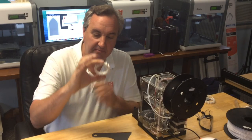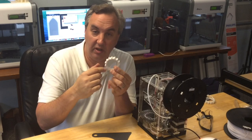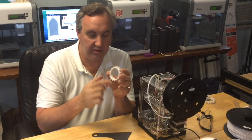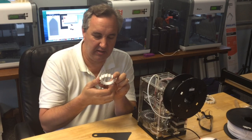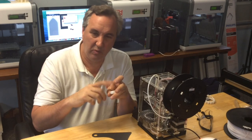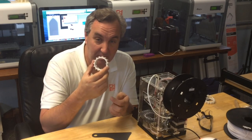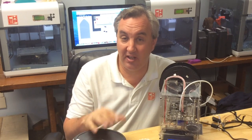There's a bunch of strings to clean up but it's pretty flexible — not super flexible, but pretty flexible. I think it's going to be perfect for a tire. I just need to print the wheel that this will slip onto and then size that to a motor. There was still some pitting on the top just like I got on the knob — there's something about the way this filament prints or flows that doesn't give you a real solid layer on top, but that's something else to adjust. Overall the Fabricator Mini did a great job printing flexible filament. I wish I could tell you the brand but I don't know — it was an off-brand I bought at Micro Center on sale, but I'm sure it represents a lot of flexible filaments out there. I'm going to try to save the slicer settings and export those and put them on my website on my Fabricator Mini page.